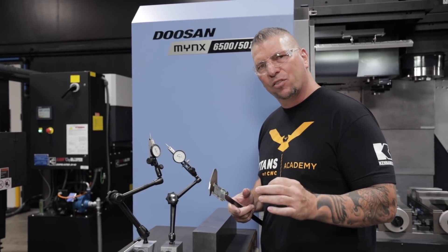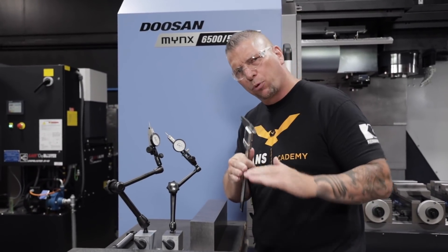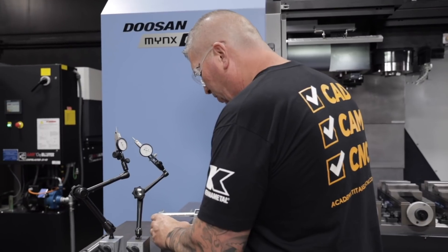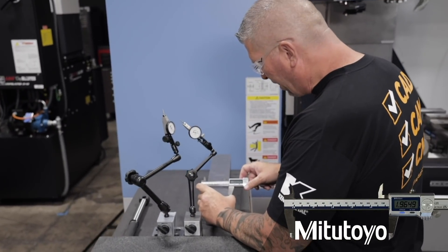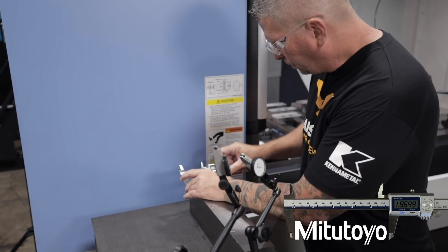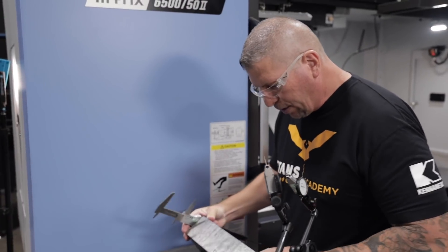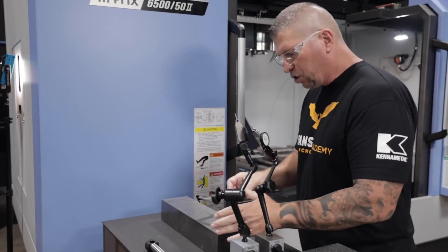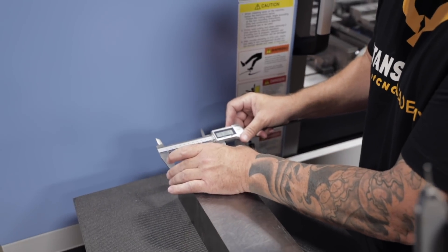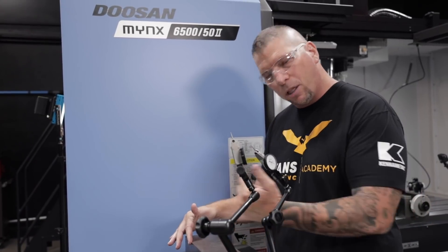One thing that we know from experience is that titanium is inconsistent when it comes to some of the cuts, and that's simply because of the process. So when we look at the thickness, we're going to see one side is going to be thicker than the other side. First thing I'm going to do is double check to see how big the material is. I got three inch, 90 thousandths, 93 on one side — and coming to the other side, that was within three thousandths, which is actually pretty perfect. Then I pop it down this way and I check this side: I got 4.210 and I got 4.186, so about 25 thousandths. What I'm going to do first is simply take this side and make it parallel to this side.